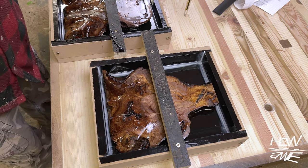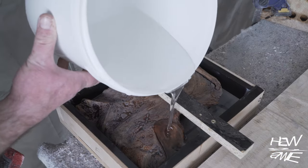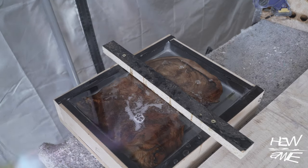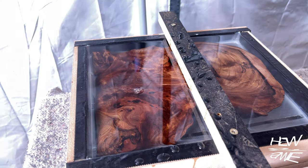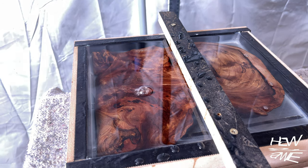After all the epoxy I've done so far, I don't like this flame torch for getting rid of bubbles — I think I prefer the heat gun. It easily burns the epoxy. If you're going to do any epoxy pouring, I'd pour it about lunchtime and babysit it for the rest of the day. It was a bit like whack-a-mole all afternoon.